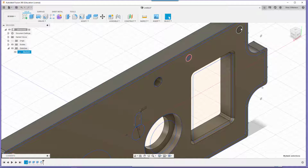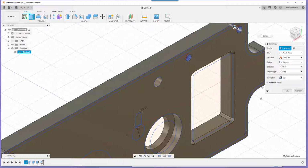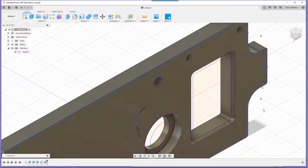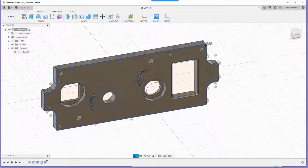and that one, then right click, press pull, and now we're actually doing all of them at the same time. Say it's 1.25, just for the heck of it, something like that. I can change it to 5, hit enter, voila. Zoom out, you can see that on all of the screw inserts, let's spin this around where we can see